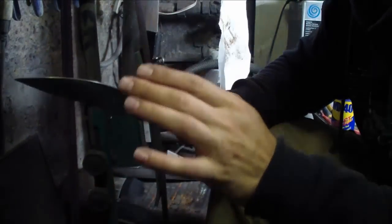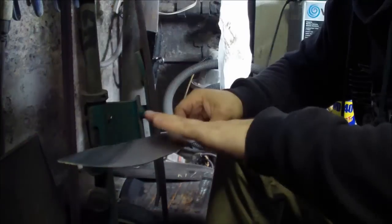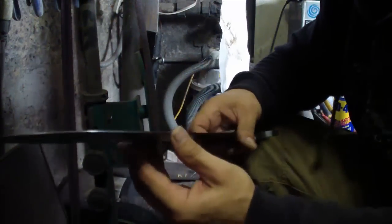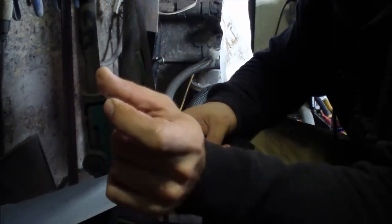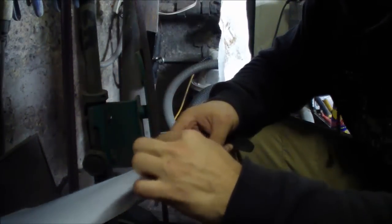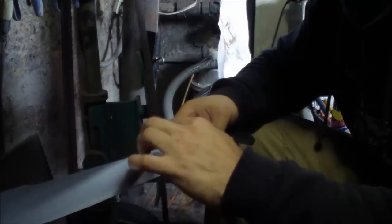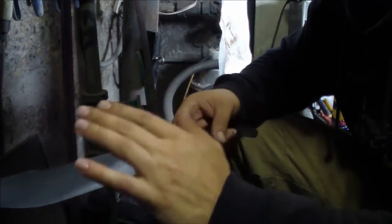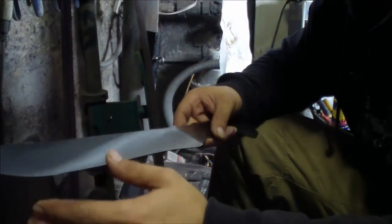That's why the jigs and the hollow grinds are easier, because the shape of the grind actually keeps the blade in place, you know, automatically. So that's why in the beginning, when you're just grinding a narrow surface, it wiggles a lot, but the deeper you go, the closer to the perfect flat you're getting, the easier it is, because it just holds its own place.